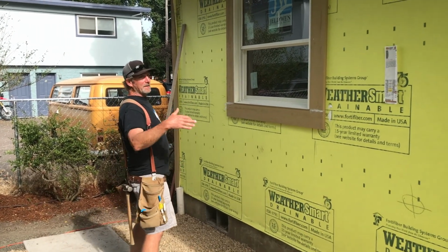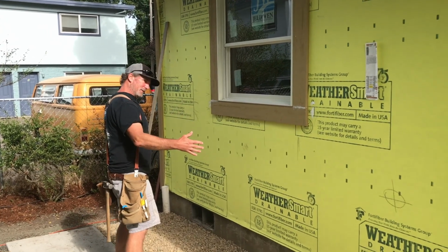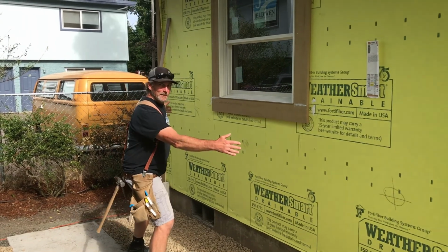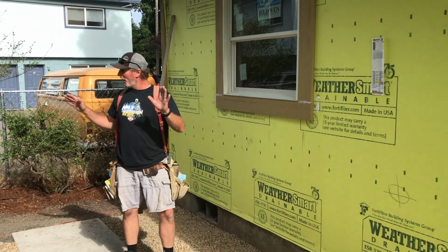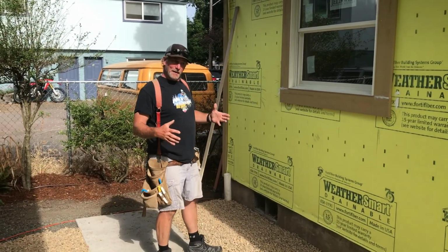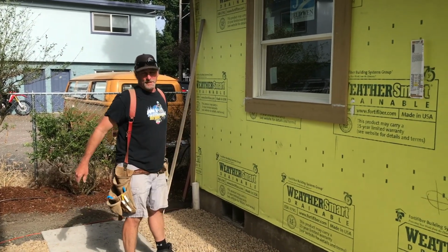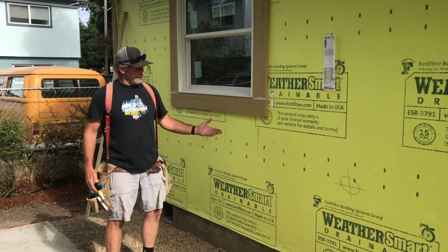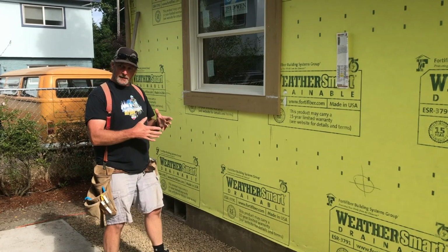I'll go as long as I can, as many as I can. I'll go to the middle, and then I'll probably jump back 32 inches, and then I may put a short one, and then a long one, and then a medium one, and then another short one. Just whatever, it's art, really. I'm joking a little bit, but I don't want somebody to look at the wall and see a pattern. I'm going to want the ends of these boards to break on a stud so that the end joints will both have a nail in them.